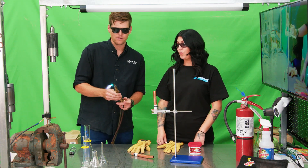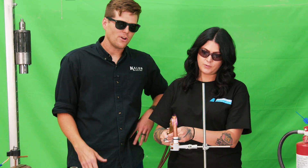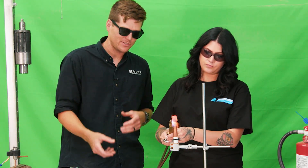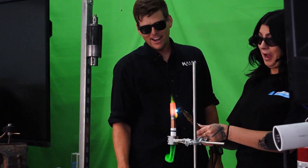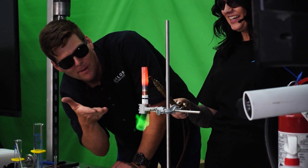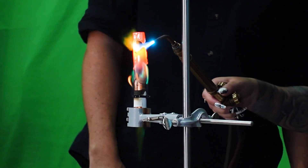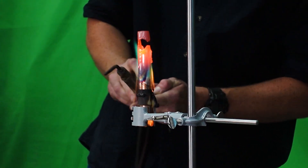There we go. So when we talk about copper, we talk about heating it with torches. We're basically trying to melt it — trying to connect two pieces together. And what happens when you get it nice and hot? You can see that temperature actually following down the pipe. It's changing colors, going all the way down to the bottom to the point where the paper catches fire. This is a bad thing. We don't want this to actually happen.